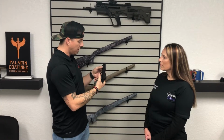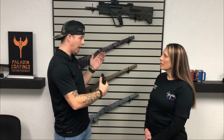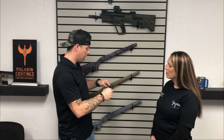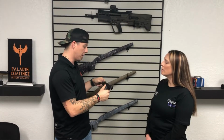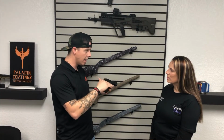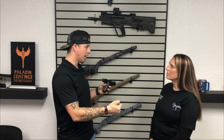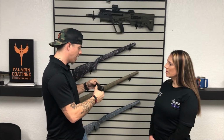Then, most gunsmiths have to fit them back together because they spray something in it, whether it's paint or whatever, and it gets sticky. Well, Cerakote reduces the friction a little bit. But more so, it offers a really smooth, really thin film coating, kind of like on a coffee cup. When they paint a coffee cup and bake it in a kiln, it turns pretty.